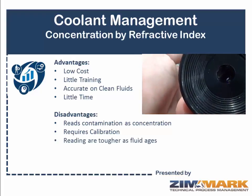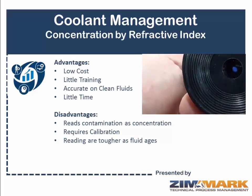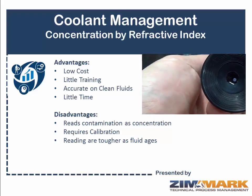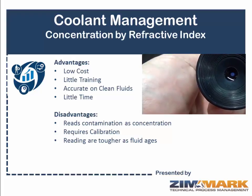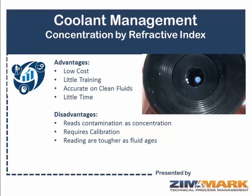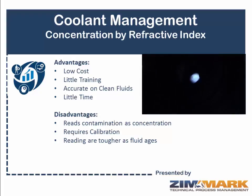And as the fluid gets aged, as it gets older, the reading itself gets more and more fuzzy, more and more blurry. Whereas with virgin fluids you have a nice crisp line that's easy to read. As the fluid ages, it gets blurrier, leaving it open to interpretation where two different people are going to give you two different results associated with what's really going on in the sump itself.